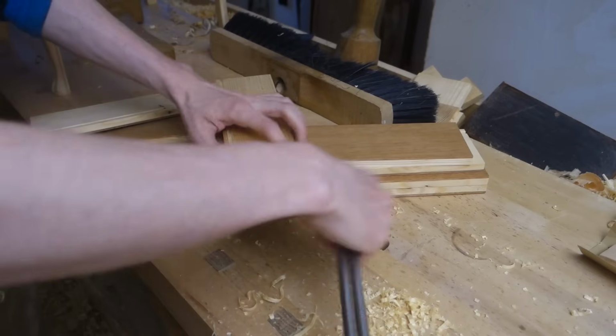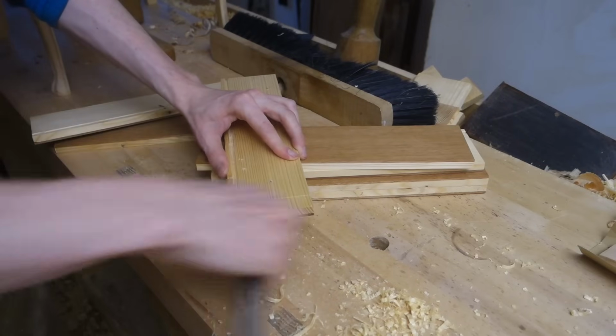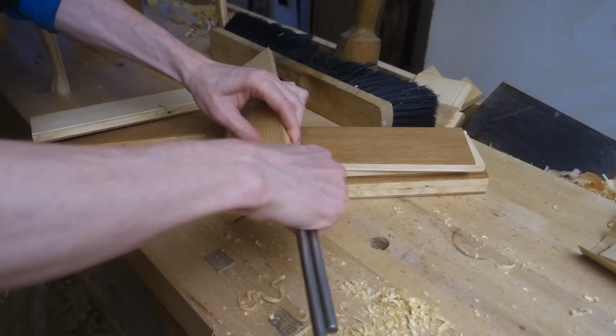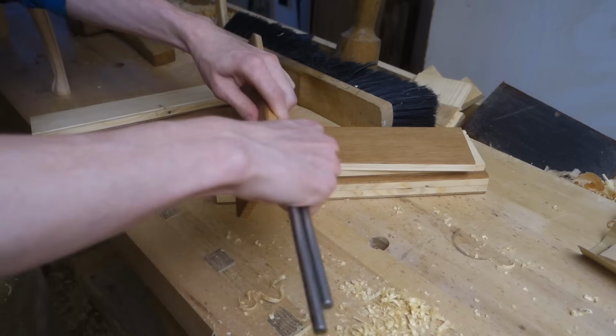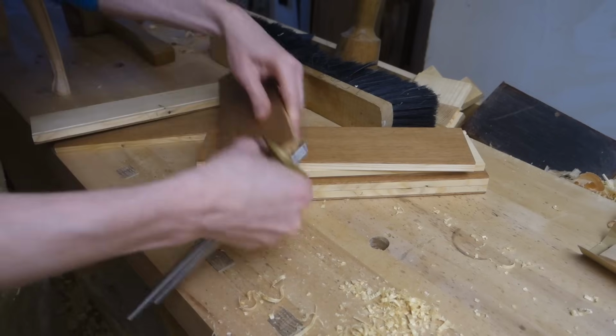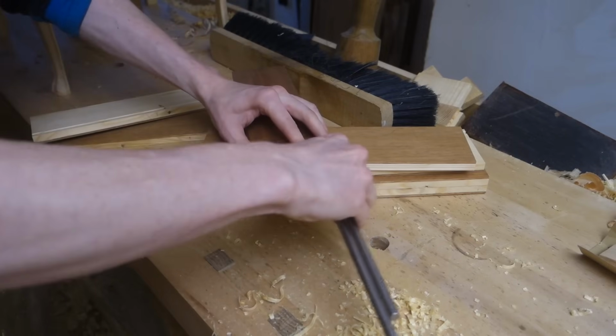With the fronts fitting, it was time for half-lap dovetails, starting with a baseline. This distance is the thickness of the straight part of the leg, minus how thick I wanted the end lap to end up, so that the front sits flush once it's been shaped.